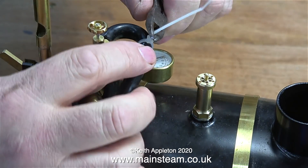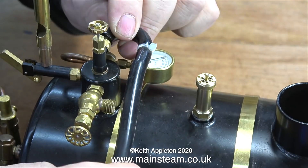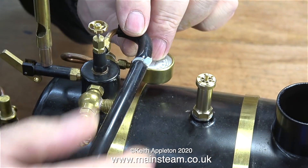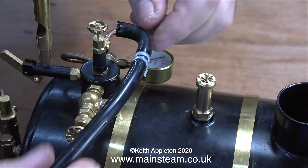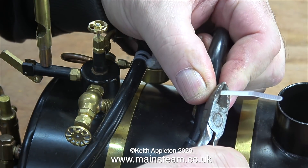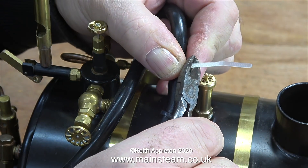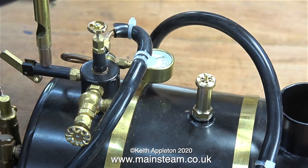Time now to set the safety valve on the boiler. I'm attaching a piece of silicone rubber tubing to a fitting on top of the turret. On the end of this short piece of pipe to the valve is a coned union, and once I fitted a cable tie, I pulled the silicone rubber tubing back until the cable tie part was up against the cone union. This should stop the silicone rubber pipe from slipping off the copper pipe once I apply some pressure, but to be on the safe side I've used some more cable ties.